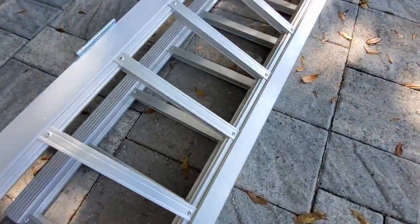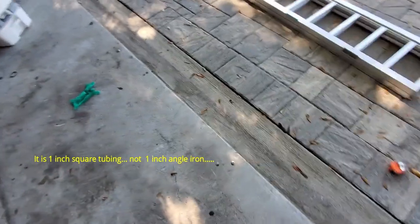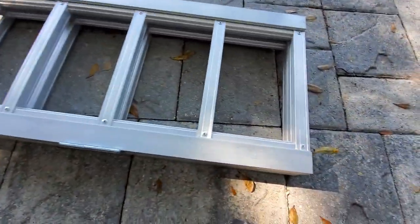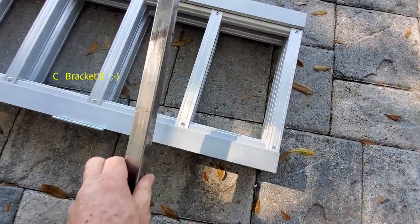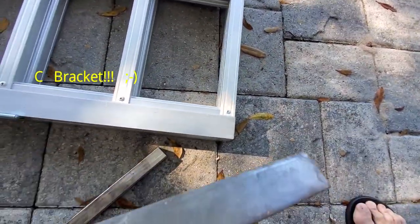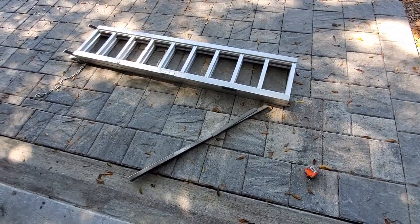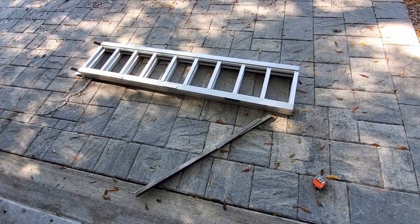What I'm going to do is take some one-inch angle iron — got some right here — and I'm going to measure it all out, get it to the right height, make a C-channel, and put these on the edges so I can bolt it in underneath. My job for today is just to make two brackets. The thing's relatively light; I just need to hold it under the trailer. Let me get started and we'll see how it works out.